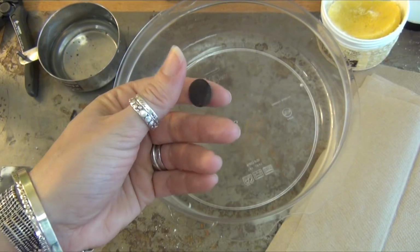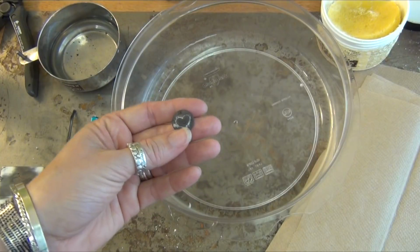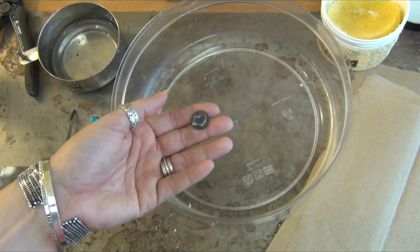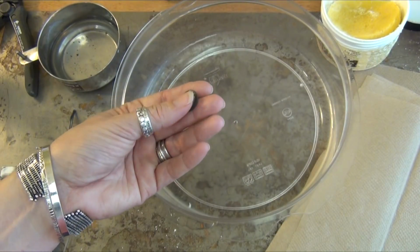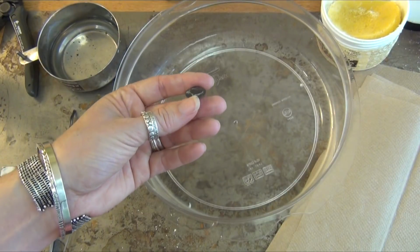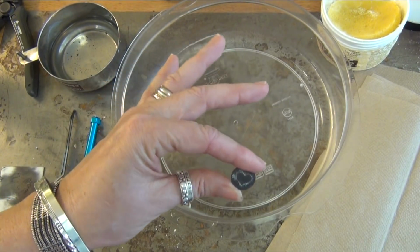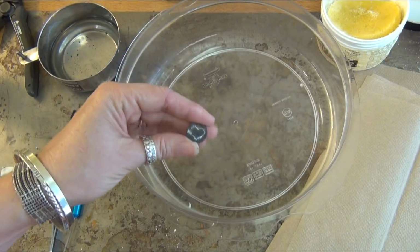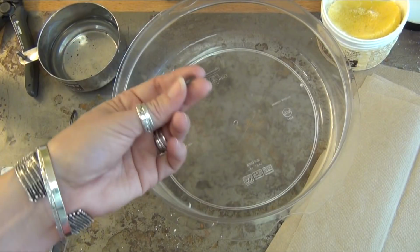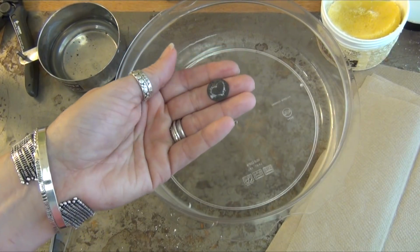Okay, so there's that. Now from here, to clean it, typically you'd throw it in a pickle pot, which we sell online; we call them the Little Dipper or pickle pot. And in there you would have either Sparex, which is an acid that will clean it, or citric acid, which is food grade and natural, my preference. There are instructions that come with it, but you'll have a warm pickle pot with warm citric acid in there. You throw this bad boy in, go away, come back in a couple minutes, and it'll be totally clean. Now when it comes out, it will look kind of powdery white, but that's okay.